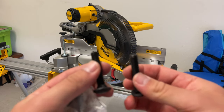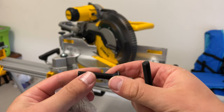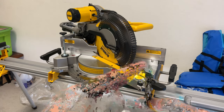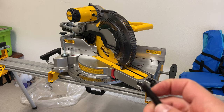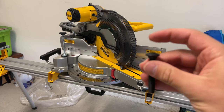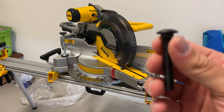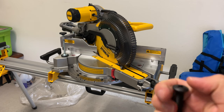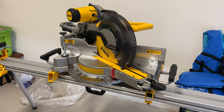For mounting, it comes with these bolts — a long bolt and a short bolt. With the short bolt you can mount it going upward, leaving the nut on top of the miter saw plate. Or you can do the same with the long bolt, or put the long bolt head-up with the nut on the inside of the bracket. I'll probably do the latter — put the bolt head on top so there's nothing sticking up and it's just a smooth bolt head in my working space.